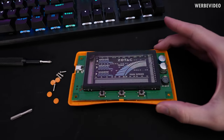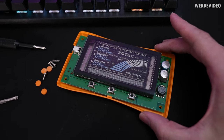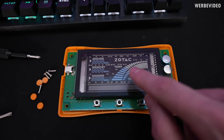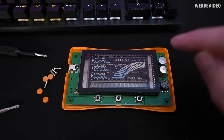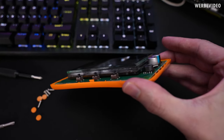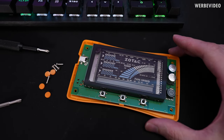Just for the sake of it, that is how the display works from the inside. It's a VFD — a vacuum fluorescence display. It's pretty old tech, something used in the 70s or 80s, exactly the same as how old TVs worked. You have these segments inside which are phosphorus coated, and the way it works is electrons are shot at the phosphorus parts and they light up. Pretty standard, pretty basic old tech.